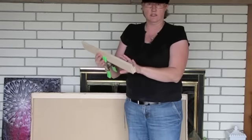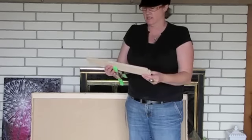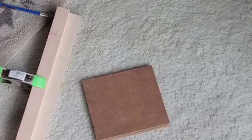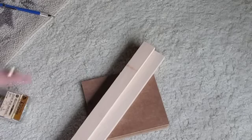After cutting the wood, I took a light sandpaper and lightly sanded all the rough edges just to give it a more clean appearance. Now that the piece of wood has dried, I'm taking the clamp off and I'm going to drill two holes in it so I can put the screw through to attach it to the wall. I've got a piece of wood underneath — I am doing this in the house, so I've got to be careful.